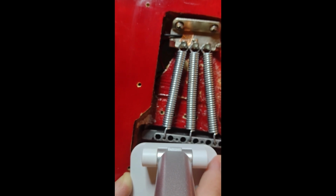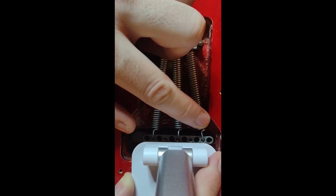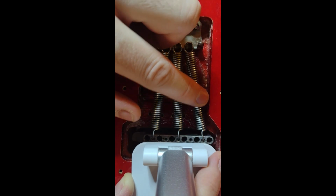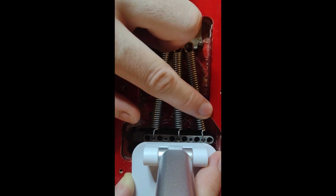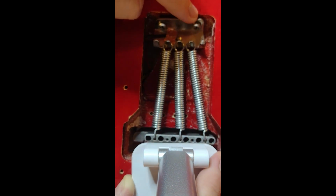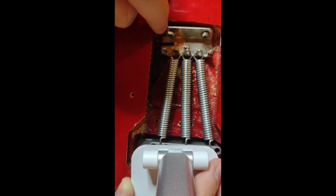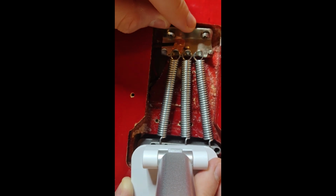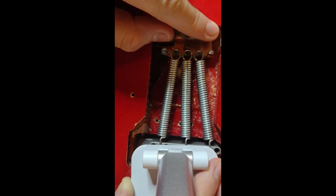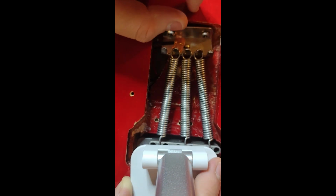I think eventually what I'll do is take my Dremel out with a sanding drum and just take away, I don't know, maybe a millimeter or two off of this edge here. And then I'll take the claw off completely, add some wooden dowels and wood glue to fill in the holes, realign this claw, drill the new holes, and then that should line up a lot better.